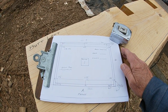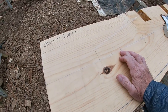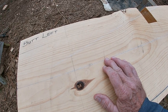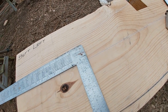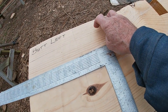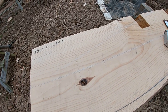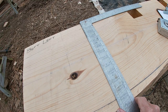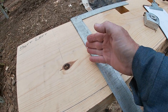They may vary within a sixteenth or so, but I've got my mark on the log coming in from the butt, showing where the center of that rod is from the string. I did the same thing coming off the center line mark, and I got a mark on the bottom and on the top. When I start to drill, I can just lay my square on those marks at the top and bottom of the log and drill straight through.